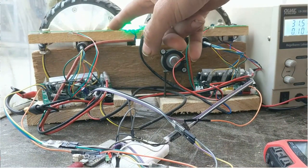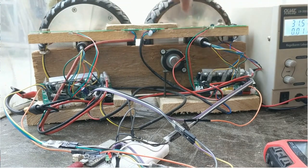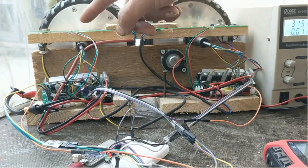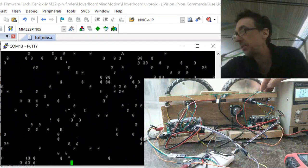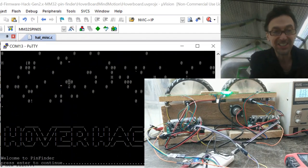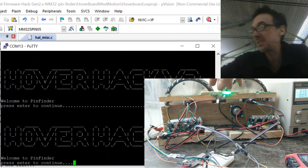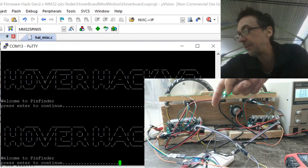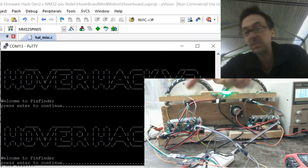Sometimes you're lucky and it's uploaded. I pull the plug and power it. It's doing something — the first step is latch detection, which keeps the power on, so all the LEDs are on and then turn off. COM is still sending garbage. It worked because the ESP32 bridged the RX/TX, sent out data, saw it come back, and now knows the connection. It starts a nice user interface.